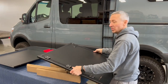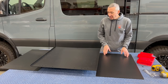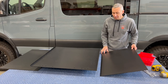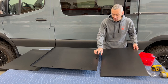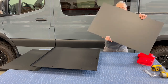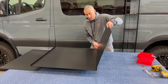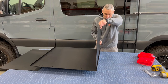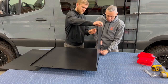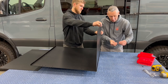We're going to set this aside and start building up. We're going to put the sides onto the back — this is just loose initially. One thing to note: if the holes don't line up, the top two holes line up, the bottom two holes line up, but the middle doesn't — you just have to flip the panel around. There's only one way to do that; you won't get it wrong. Set this up here like so, put a bolt through there. An extra set of hands really helps, but you can do it solo.